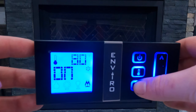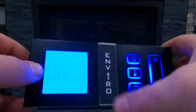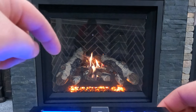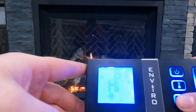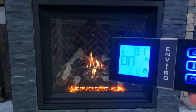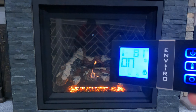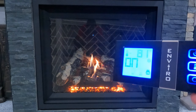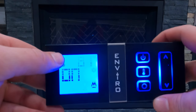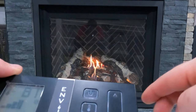If we hit the scroll button again, we'll see a double flame icon, and we can see that it's on. This particular fireplace has a front burner and a back burner. If we go to the double flame and shut it off, the back flame shuts off. We can turn it back on and the back flame turns back on. Not every fireplace has this feature — if your appliance does not have a secondary burner, this option won't do anything.